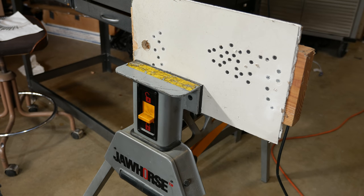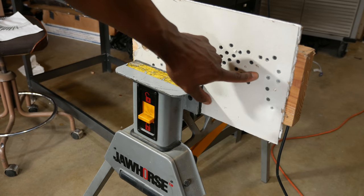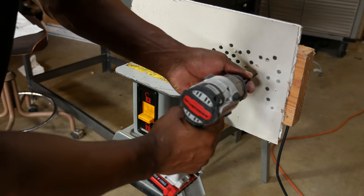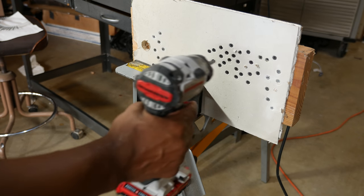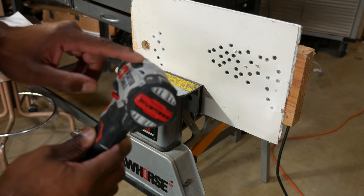I'm going to go ahead and put the screw gun to the test. One of the complaints I see quite a bit out there is that these screw guns don't work very well, and that comes down more to technique than anything. These screw guns take a lot of practice to get used to because it's a lot different from using an impact driver or a cordless drill driver. As an example, I have my impact driver with the drywall screw. I'm going to drive the screw through this drywall and into this 2x material here. You can see that as I was driving the screw in, the impact driver kicked in and started doing a lot of hammering action to get the screw to sink. That's the difference between this kind of tool and a screw gun — the hammering action comes into effect and aids in driving the screw.